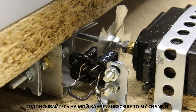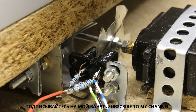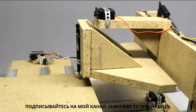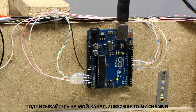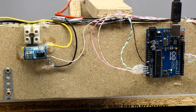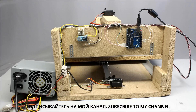The rotational encoder is scanned by two photosensors. The state of the sensors is read by the Arduino Uno. The third axis is moved by a normal servo. The Arduino is mounted at the back side of the CNC machine. There is a 12V relay used to switch the router, controlled by the Arduino through a small signal transistor. An old computer power supply feeds the machine with electricity.